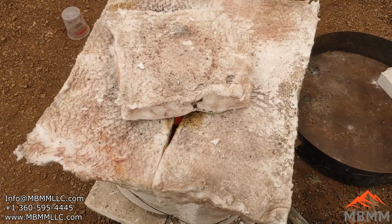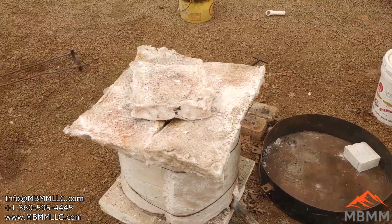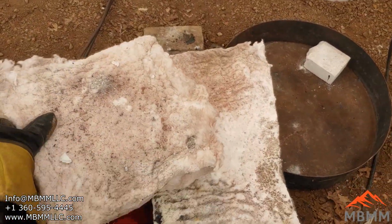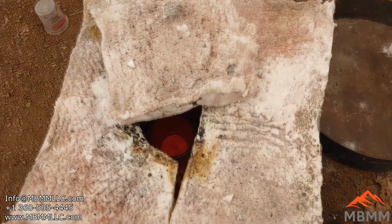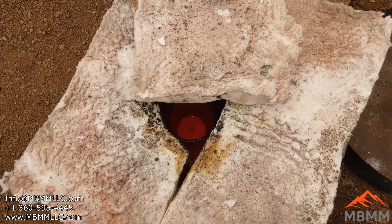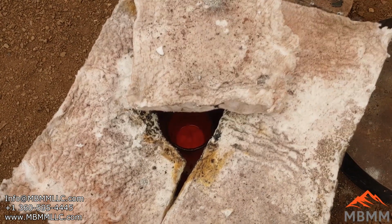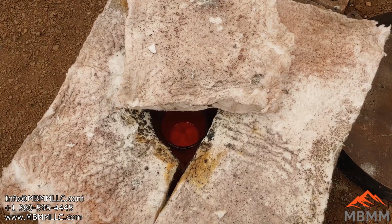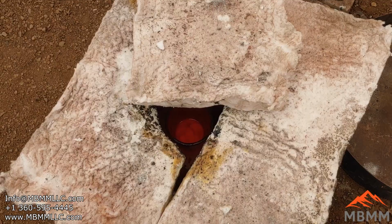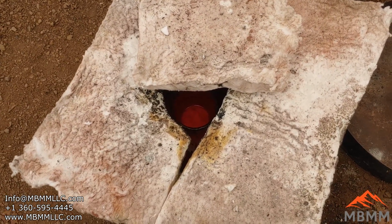And my theory is, let me pop this open so you can see. My theory is that the bubbles we're seeing is the zinc. It's the zinc boiling essentially and going into the gas phase. It's still going there a little bit. So I think that's the zinc coming off because it gets past the zinc boiling point.